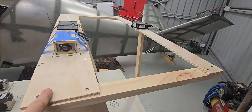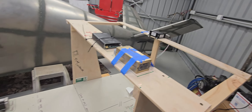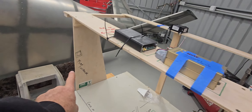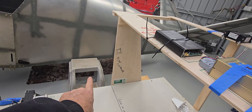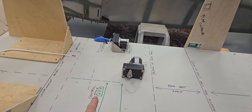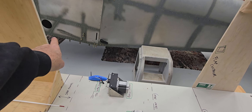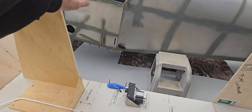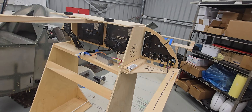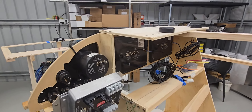The route runs along this way, picks up the back of the cross tie box, picks up the transponder, the VHF radio comms, and the two headset jacks on either side — that part is fairly consistent with what most people have. The flap controller comes down, picks up this line, drops down under the seat pan, picks up the two autopilot servos and push-to-talk, and then works its way along up the spar tunnel, forward of the spar tunnel, into the back of the instruments. Looking at the back of the instruments — fairly accessible, well it is accessible now.